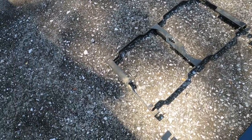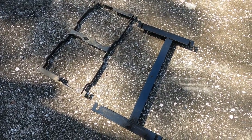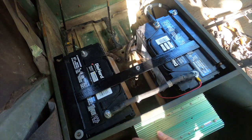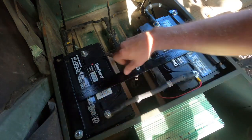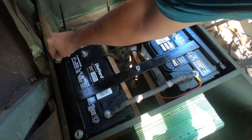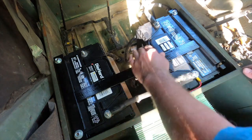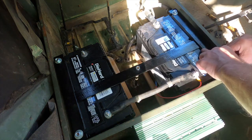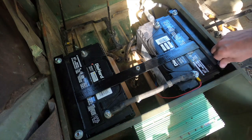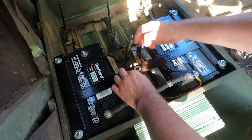So there you have the new frame for the new batteries, and the old frame we'll put back into the system. We'll go ahead and bolt this up and get the batteries bolted down. I've got the batteries positioned right and I decided to put a little foam tape underneath the metal so we're not pushing the metal directly onto the battery on the ends. I'll throw some washers on here — I'm going to need something to space these apart, probably just a block of wood. They're not going to go anywhere when we get it tightened down between the wood on the bottom and the foam. The foam may have raised it up a little bit too much but it will crush down.